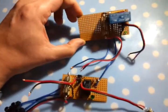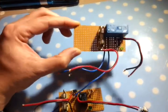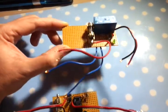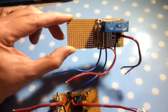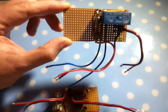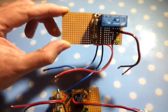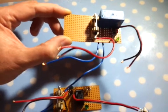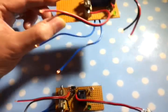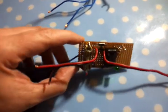After the problems we were having with the cell log 8 and its erratic alarm output, this was the original relay module — a straightforward follower relay that went on when the alarm output was normally closed as an enable signal for the inverter. The firmware on the cell log 8 has fixed the transition problem of triggering multiple times near the set point, but that still didn't work very well. So what we've come up with now is an interim fix which uses a different kind of relay.